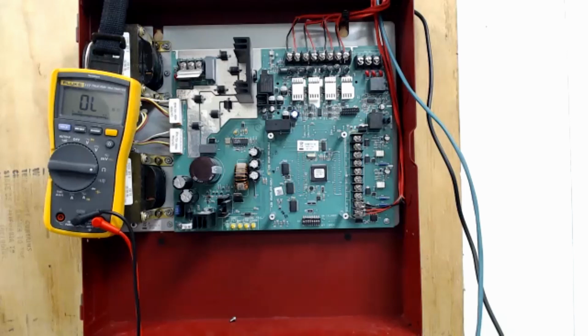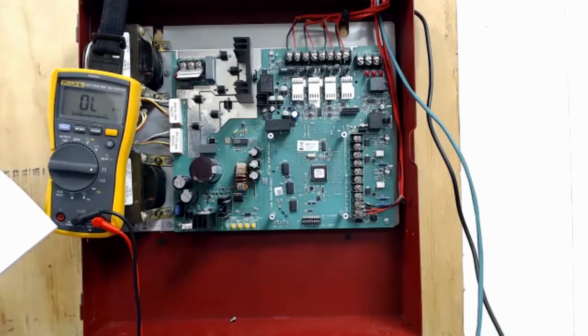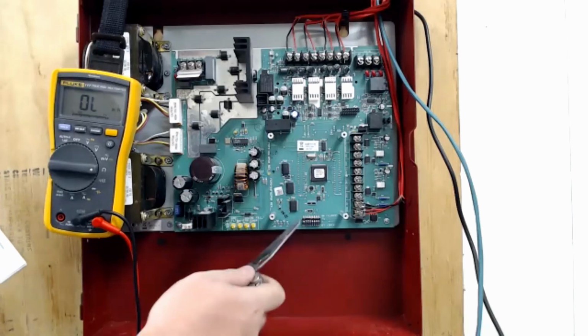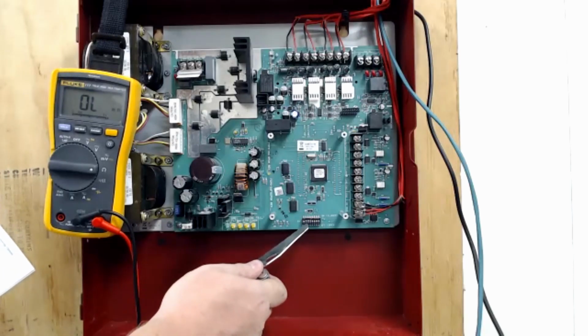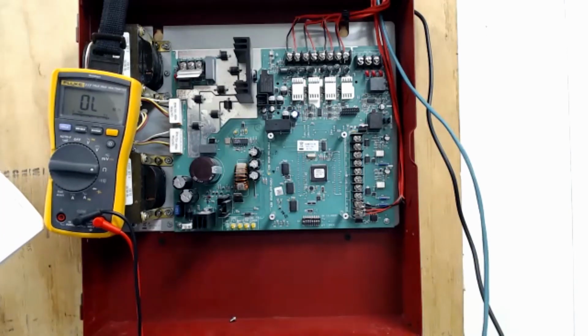Now this is an old power supply that came off a job. I think it's actually bad, so I'm not going to power it up today because I don't think it's any good. It tells me that if 1 is off and 2 is on, that is set for system sensor strobes. So this is switch number 1 right here. This is switch number 2, just the first 2 from left to right. That's where you set what type of devices are out there.